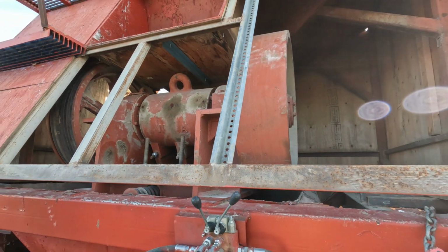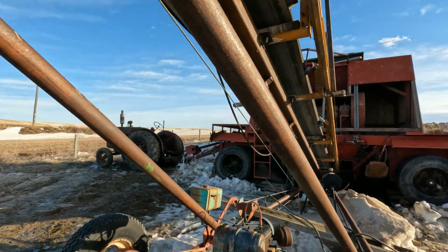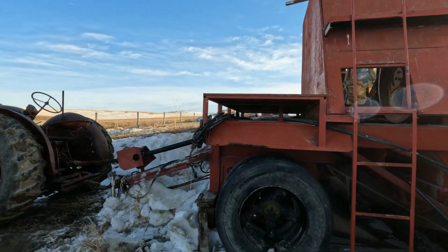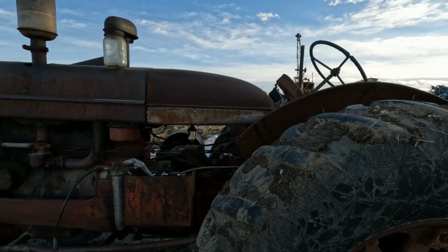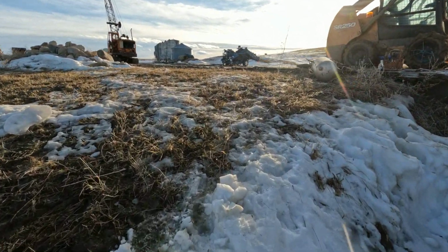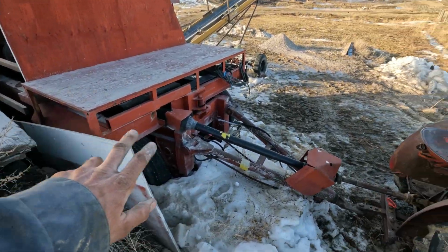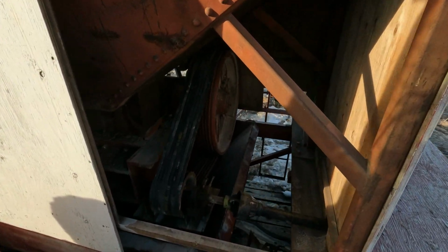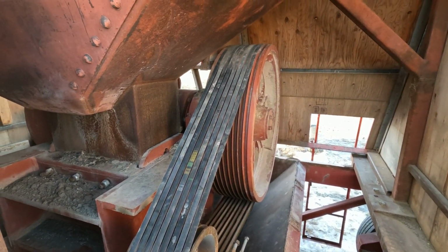And then I just made the PTO system. We had designed the PTO for a 200 horsepower tractor because that's what they said it would take to run this thing. Now that's probably when it was at full capacity, but I built the drivetrain to withstand 200 horsepower, and we hit all the RPM requirements and everything, and so here it is.